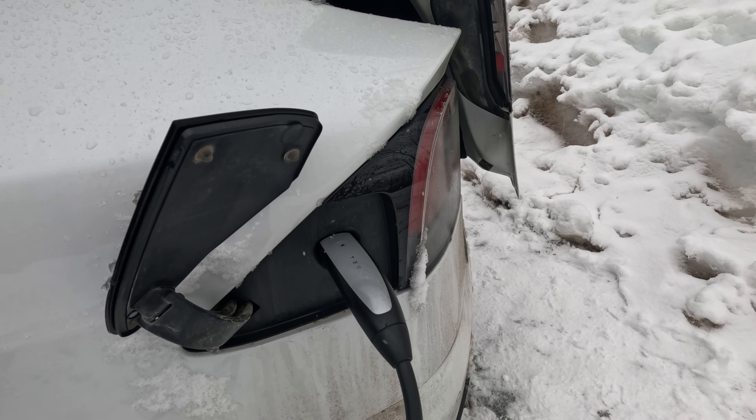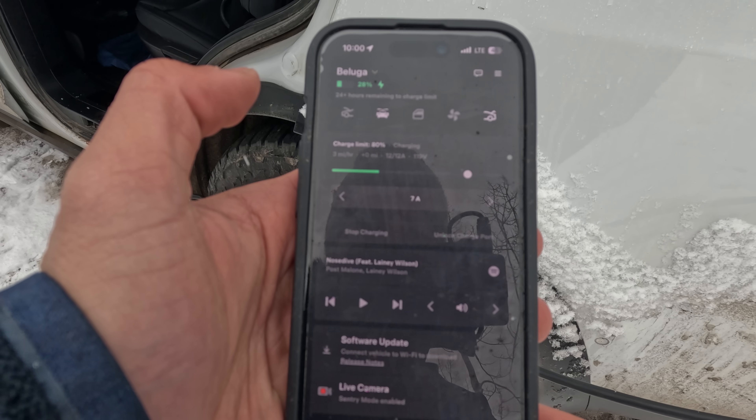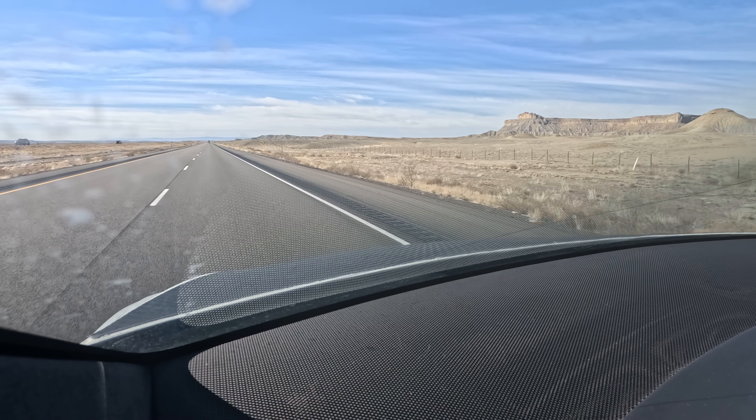It's blinking and connecting — great, we're charging. I'm dropping down from 12 amps to 7 amps. Right now we're at about 800 watts of output, still zero watts of solar input. It says about two hours of battery remaining. For days like this — foggy, snowy, super rainy, mother nature throwing everything at us — what's nice is that on sunny days the EcoFlow is constantly topped off by the solar panels. I can cook, I can drive, I don't have to set anything up. That's why I got these, so on my expedition through Central and South America I can just drive and not worry — just make sure the car gets some sun rays, premium juice.